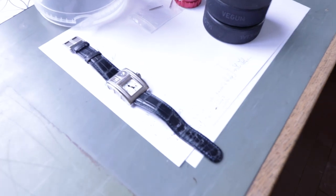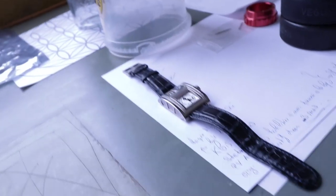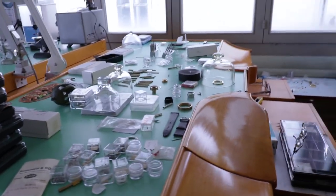And this is a gold fill? Yeah, right. It was here for a service. And this area, also this bench, is also my area. It's the place where I spend a lot of time for the finishing, polishing, angling, anglage. Also to assemble the watch for each function, to set the function and make it right before the final step and before the anglage or the finishing. I try the function here, it's producing some dust, which is why I prefer to work here and after to save this other place, to keep dust and things separate.